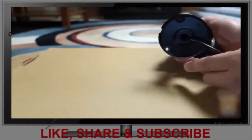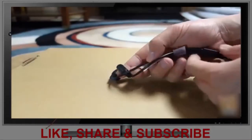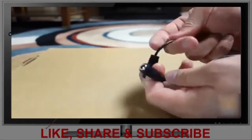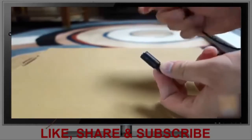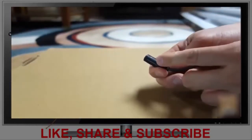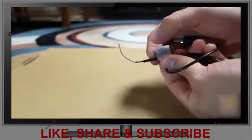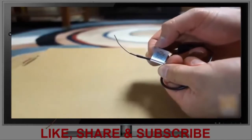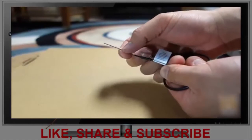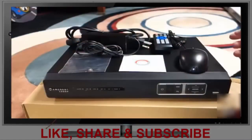The bullet camera is held to the wall or ceiling by three screws. The cable runs 10 to 12 inches before it splits. We have the coaxial connection, the DC 12-volt input connection, and the brown and white cables. The tag also says the default is HD mode, but shorting those two cables switches it to SD mode.